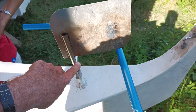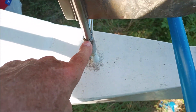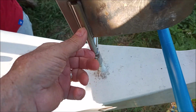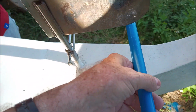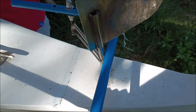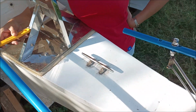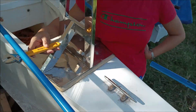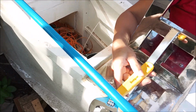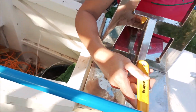And like I said, here we're going to have to weld a tube onto here. I don't know how high. We may go 3 inches high, just so this doesn't try to ever go over the top of it. See, if it's too high, we've got to get that down to the right height. And it may just be a little 3/16 rod coming out with a loop in it for this to go through. That may be all that we need.